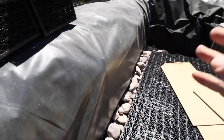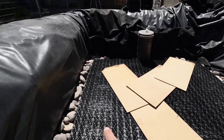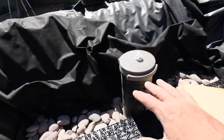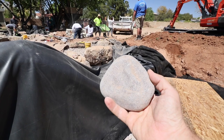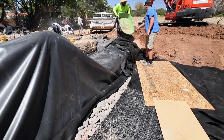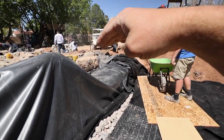Our liner and underlayment are in the excavation — that's what makes it watertight. The snorkel and centipede modules are all in, placed before the aqua blocks. Now our aqua blocks layer is in, and we've backfilled around the outside edge with cobbles to lock it all in tight. We're going to start putting graduations of rock inside the wetland filter — about eight inches of larger cobble at four to six inches, then stepping down to two to three inch, and finally three-quarter inch gravel on top. The water passes through three layers of gravel before it exits at the top and makes the waterfall. Why is it crucial that the layers are all separately sized and the smallest size is at the top?